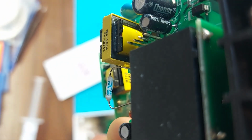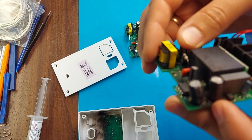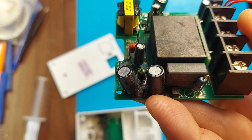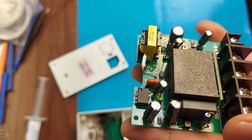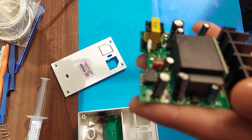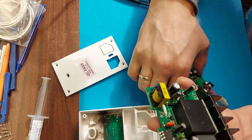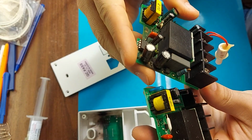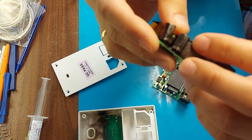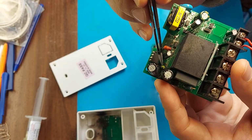The fuse is designed for 115 degrees. This is the first burnt element and the next one is L2, an inductor, only in SMD format. In appearance, this element looks like an SMD resistor or an SMD capacitor, but in fact it is an inductor. I don't see any more burnt elements visually yet. There is another inductor here. It is black on the side. Perhaps it has burned out, or perhaps this is carbon deposits from another burnt out radio element. The coil is called L1.